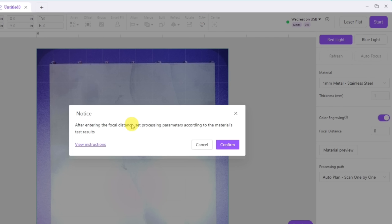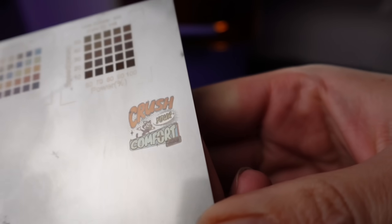You can now assign colors in your laser project to whichever speed and power setting from the color array. Make sure all your engraving settings are set to 300 for the density, and make sure the color engraving toggle is switched on. If you find a color setting you like for a thin keychain and try to use the same settings on a thick flask, the results would be vastly different — we are setting colors to this exact focal point for this exact object, so you'll need to start with the color array and focusing process every time.